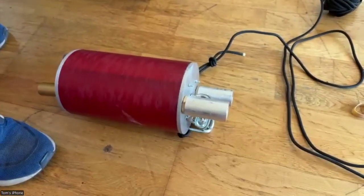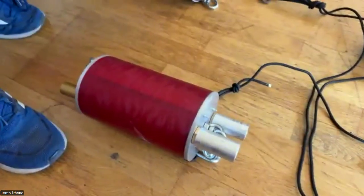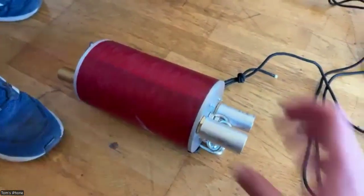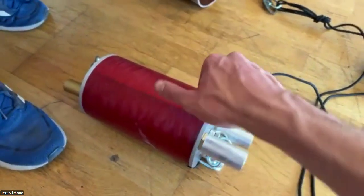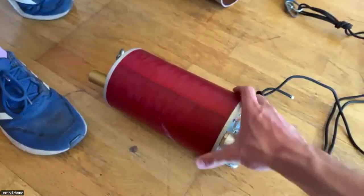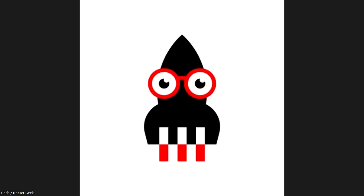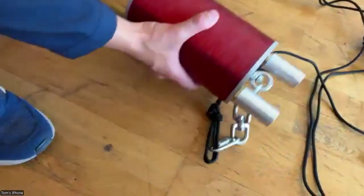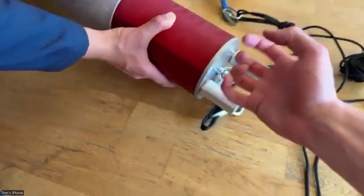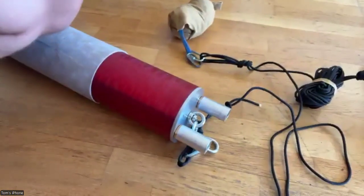So the bolts go into the coupler tube, is that what I'm hearing? The coupler, the upper airframe and the ring. The ring will sit about here-ish, and then the holes will go through the airframe into the coupler, and the retaining ring here will stop it moving laterally or rotationally. Okay. Is that smaller diameter than your tube? Yes, it sits inside. So the retaining ring will sit inside this coupler tube here, and its external diameter will be the internal diameter of this. Gotcha. Okay.